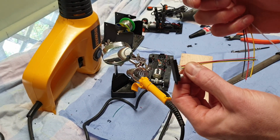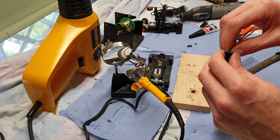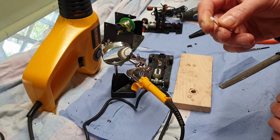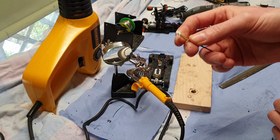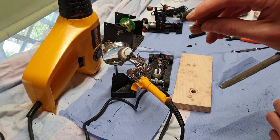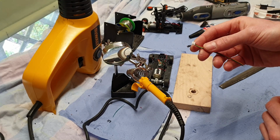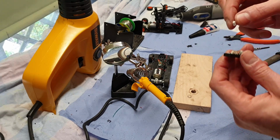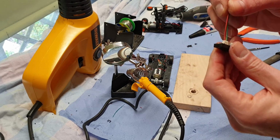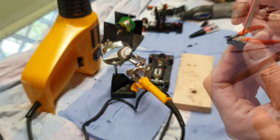This one's, I think, a 2mm, and this little wiring harness here is, hang on, it's really stiff. That is a JST 1.25mm 4-pin plug and harness. You can get them for, I think, about £3 for 5 on eBay, and they plug straight into there. So you don't want the 1mm, you want the 1.25, and you can see that fits just perfect into the thing there.